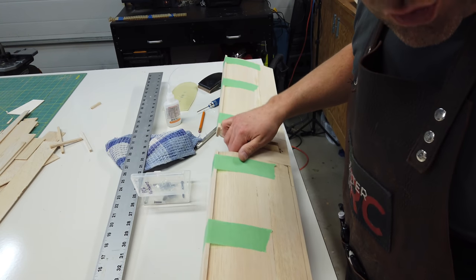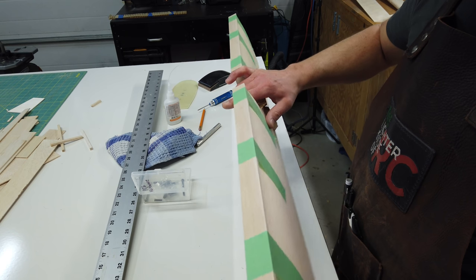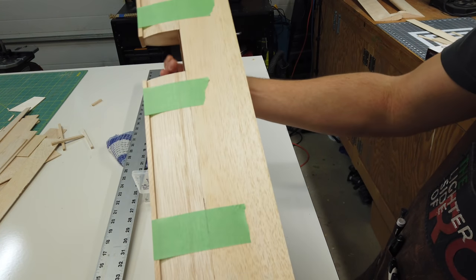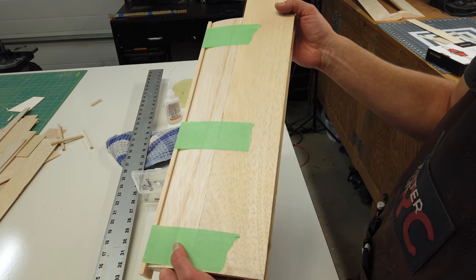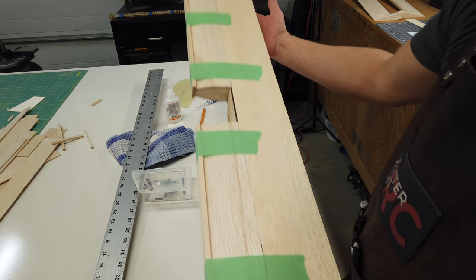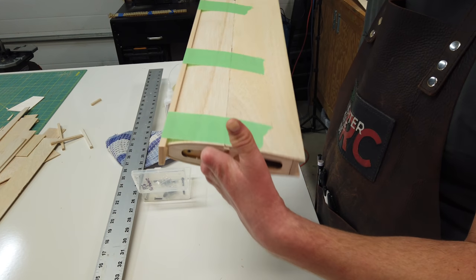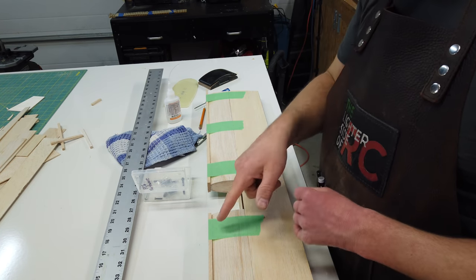The horizontal stab is all essentially done, except obviously the leading edge - I just glued the leading edge on and everything else is finished. We had to do that little patch in the trailing edge area - that's done. We've got the top section all done, and the fitment of the fairing or edge pieces all done as well. Everything is wrapped up. The only thing left is once this is cured, we will shape the leading edge. With this horizontal stab all sheeted, it is extremely stiff - it was quite flexible before when we had it on the airplane doing mock-ups, but now it's extremely stiff. That worked out good - fairly straightforward. I'm going to work on shaping the leading edge next.